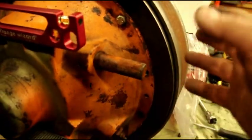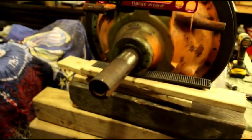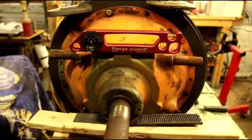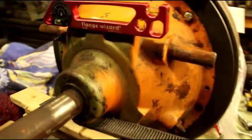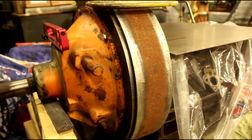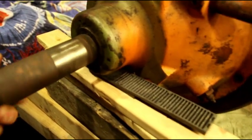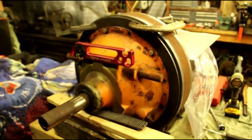We'll take the clutch off, we'll take the flywheel off, we'll take the bell housing off, and then I can finish weld it. But right now I've got the engine upside down, and I have the clutch upside down, and I'm getting it leveled up. I have the block jigged up so it's perfectly level. I have the PTO level, and it's just a matter of carefully tacking it up now, and little by little we'll get this put right into place. I have the bearing on this, and that's sitting in the flywheel, and I made sure everything is free spinning, nothing's binding or anything, and very carefully we'll go at this, and I'll show you the progress along the way.